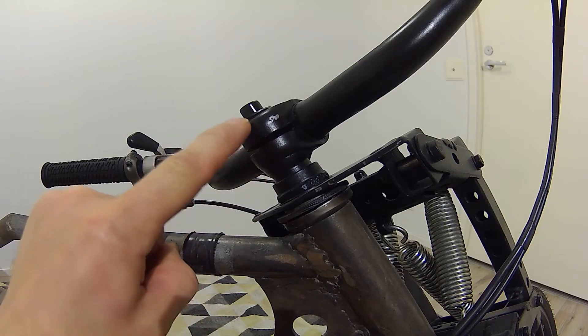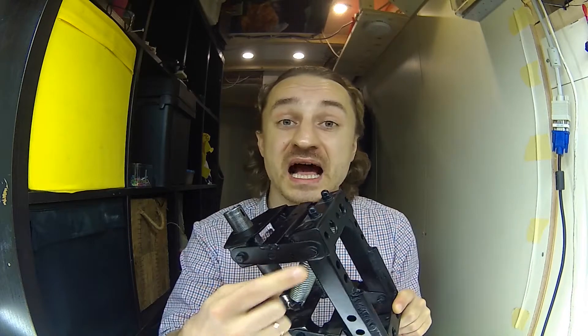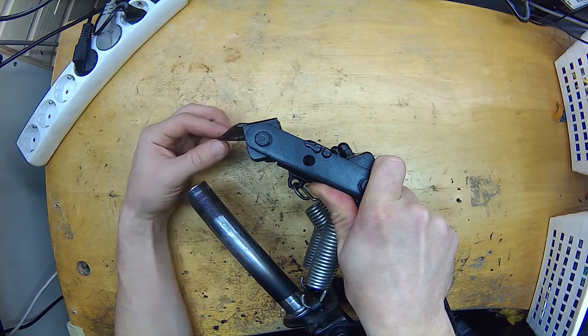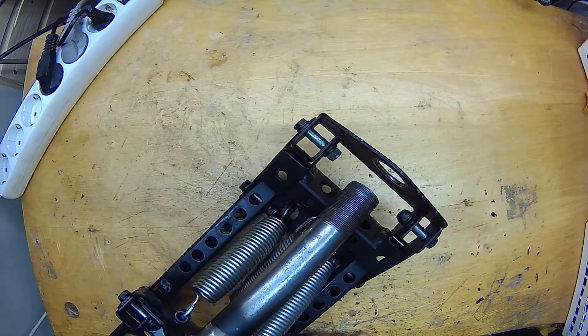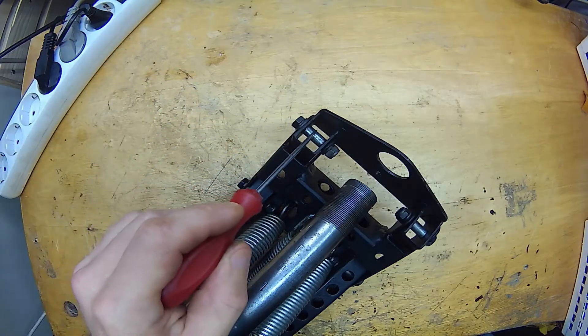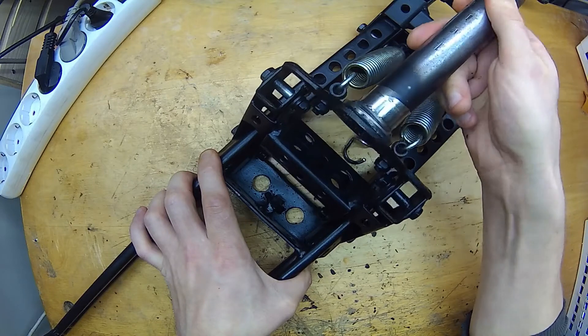This stem is also a nice old school piece with a bolt in the center. Since all of these moving parts are connected with bolts and nuts, there is a challenge of tightening them up. You need very tight connections to prevent this structure from twisting, and at the same time you need to be able to use those connections as axles. So I found a round tube of suitable diameter and used that as bushings. A bushing is pinched between the outer part with the bolt and moves freely inside the inner part. These bushings are just slightly wider than the width of the inner part, so the connection can still move and be very tight at the same time.